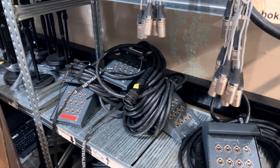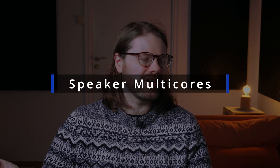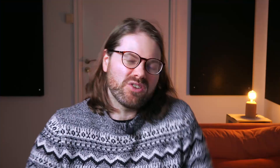If you get multiple of these connectors and stage boxes, you can just have four big connectors, and suddenly you have 48 inputs plugged in with just four cables. But it's not just microphone signals that we need to transport lots of on a stage — we also need to transport speaker signals. When you start having to run eight separate speaker cables to the front of the stage, that's quite a lot of cables to pull. But we can employ the exact same understanding to multi-core speaker cables.